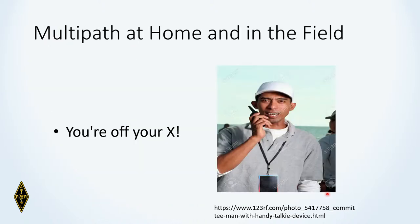Most of us with our technician licenses are going to be operating on VHF and UHF, and we're going to be operating through amateur radio repeaters in our area. And a repeater, as we talked about in one of the earlier classes, is just something that's way up high, maybe a tall tower on a mountaintop or whatever, and with your little HT, you transmit up to the repeater. The repeater repeats it on a slightly different frequency, and it comes back down, so someone else a long distance away can receive you.